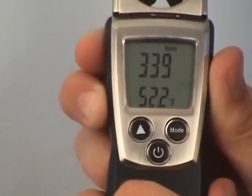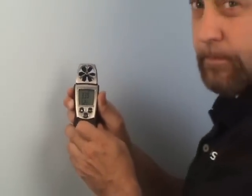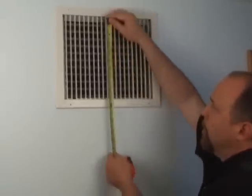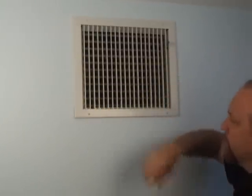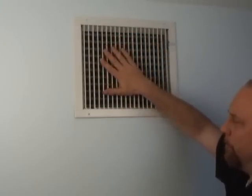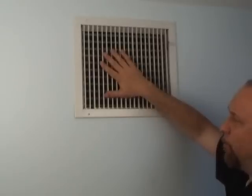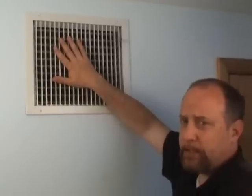That's how you get the average on the duct. Remember, this is feet per minute, which is a velocity. In order to get CFM, we need to finish out the process. We have a supply register where we just measured the air velocity, and we want to calculate the approximate CFM of air coming out. We need to measure the open area of the register, which is 11.5 by 13.5 inches. We also have to consider that this register is not 100% free open area — according to the manufacturer's literature, it has about a 0.9, or 90%, free open area. Let's go over to the board to do the calculation.